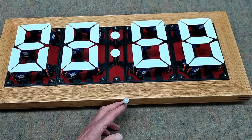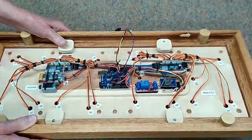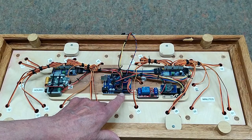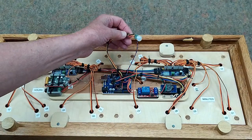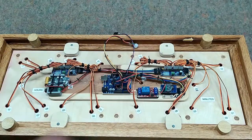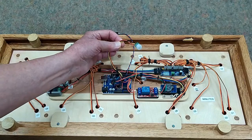This clock is using the 5-volt PIR, and the wiring for this is a little different. We're still using 12 volts to VIN on the UNO, but we only have 5 volts going to the PIR. The relay is still switching the power on and off to the servo driver boards. The following diagram is for wiring this clock using the 5-volt PIR.